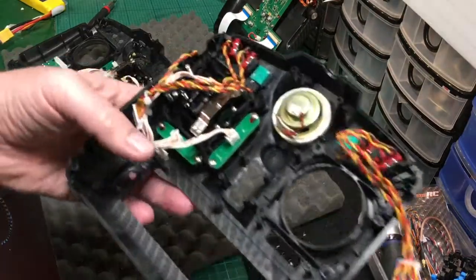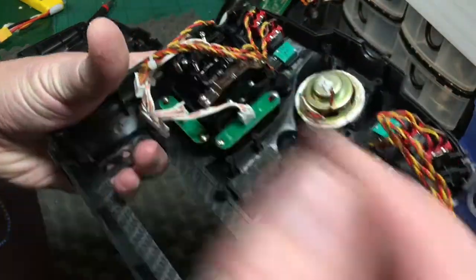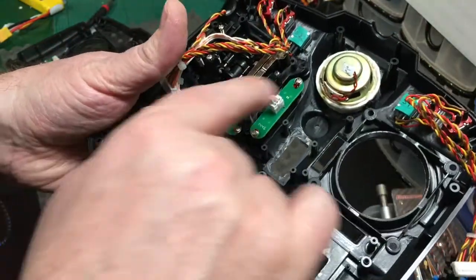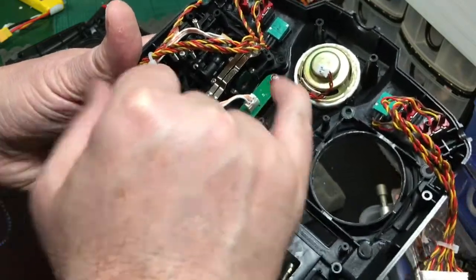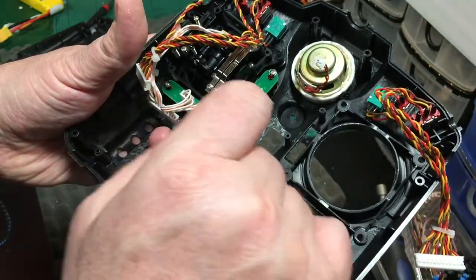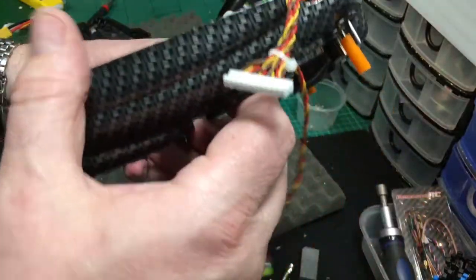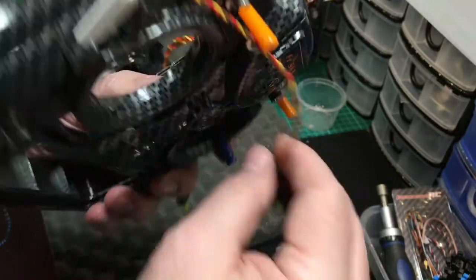All right, so there's one gimbal in. What you notice — I stripped it all down, took all the screws out the front and the back. When I took them out, I made a note of which way the writing is, so which is top, because you don't want them flipped 180 degrees. That can be confusing when you're trimming. And when you screw them back together and you put the units in, just test to make sure that they are clicking and that they're working.